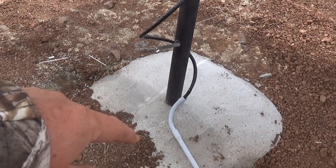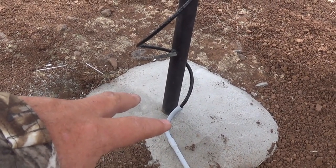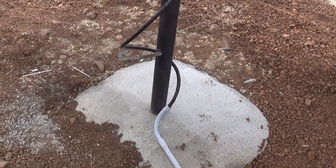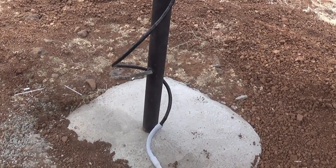The pole goes down into the ground — it is one foot into the ground. Then this whole cement slab is four feet in the ground. I also put some rebar in there, tied the rebar all together, and tied it to the pole — that's also two feet in the ground. From what I understand, that should be enough to ground the panels.